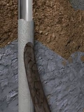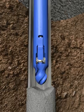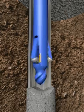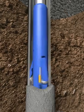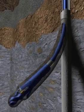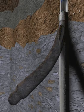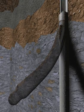For under-reaming applications, the lock-o-matic can be dressed with any type of roller cone, PDC, or bear claw cutters. The cutout into the formation is then made and under-reaming is begun. After the hole is opened to the specified diameter, the lock-o-matic is pulled out and the well's completion phase is begun.